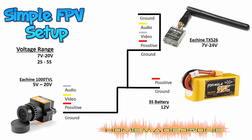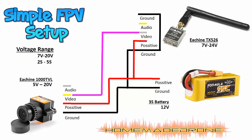Let's start connecting things. Connect the grounds from the camera to the battery and also to the transmitter. This transmitter I'm using here is just awesome — if you're starting out and don't know the components, please take a look at our review for it. For the positive, the red wire runs through all three components: the red on the transmitter goes with the red on the battery and also the red on the camera. Then to keep it really simple, just connect the video output from the camera to the video input on the transmitter — that's it. I used a pink color for that wire in the diagram, just noting there's no convention for the video wire color.